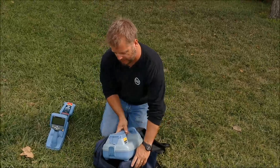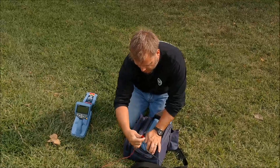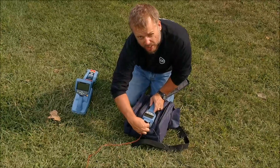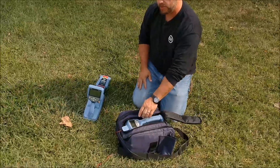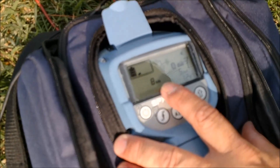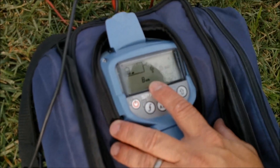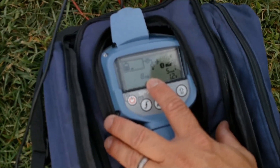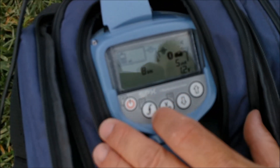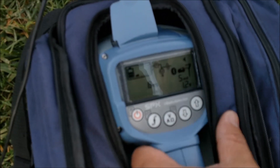We're hooking onto a tracer wire for a gas line here, so I'm just going to pack it back into my bag and plug it in. We'll just use eight kilohertz, but your basic frequencies are found on the screen of the transmitter. What I've done is plugged in the direct connect leads to the front of the unit. I've put the black lead to a ground rod behind me — you always want to try to get it around a 90-degree angle from what you're locating, just get it away so you don't interfere with the locate. And then I have the red lead hooked onto the wire over here. Our frequencies are found on the left side of the unit.